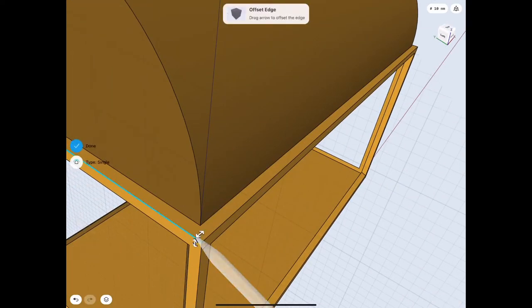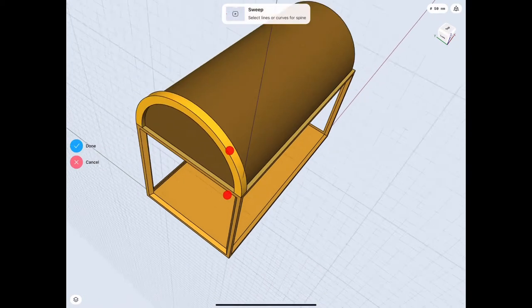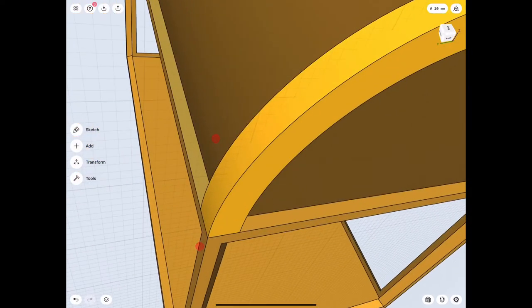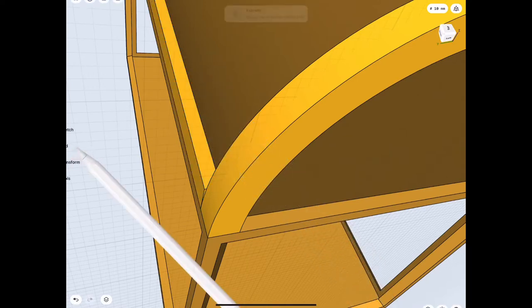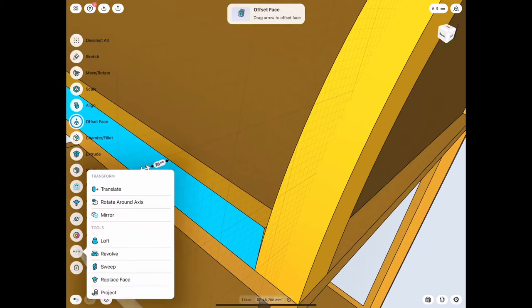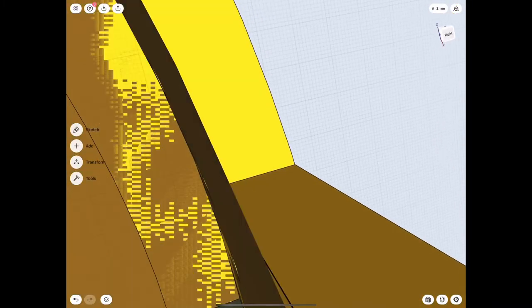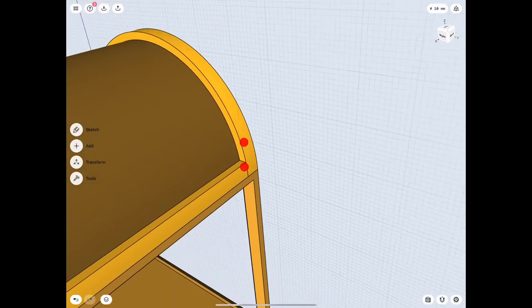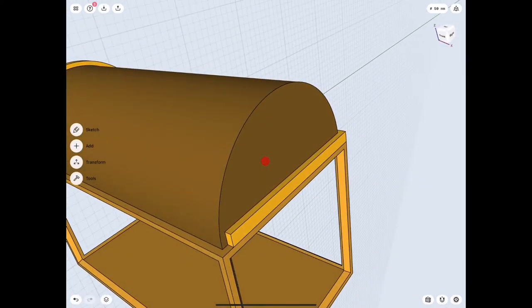You've probably noticed by now I use the offset tool pretty often, but sadly you can't do it on a round piece - so we'll be happy when we've got those squares. We can use the sweep tool and just follow the contour to make our life even simpler. You don't have to sketch anything new or make new shapes. Then we can extrude the floor and make sure you make it as a new body so it's not coming out of the bottom frame. We're going to replace the face with the rounded part so it matches, and then also connect those and replace that face as well.